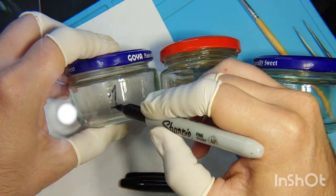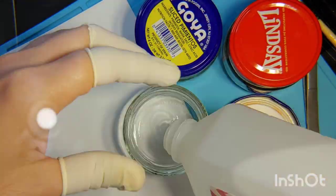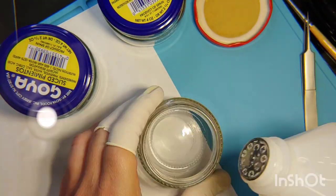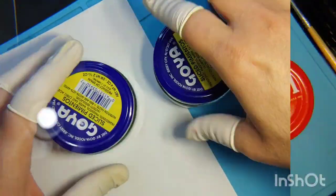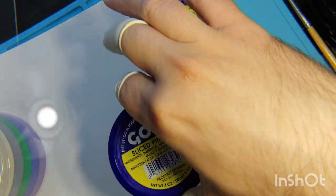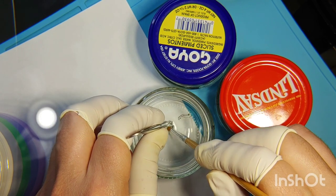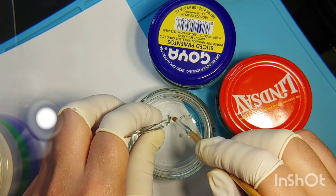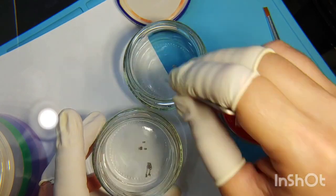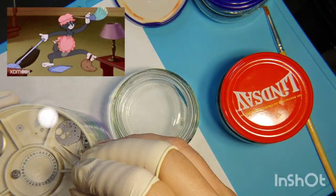On the second stage, I label three containers 1, 2, and 3 and fill them with 99% isopropyl alcohol — this is the rinsing stage. I pass all parts from the first to the second container and from the second to the third without skipping any number, making sure by the third rinse there's no trace of grease or dirt. Most of the time, a watch runs poorly not because of a broken part, but because lubricants break down, forming a thick paste that reduces energy distribution. Many problems can be fixed just by doing a good cleaning and proper lubrication.